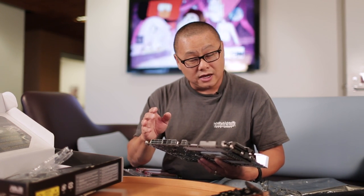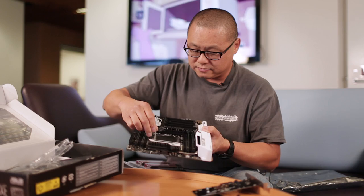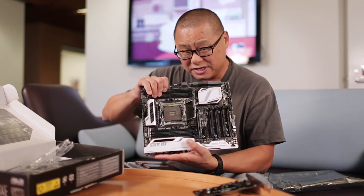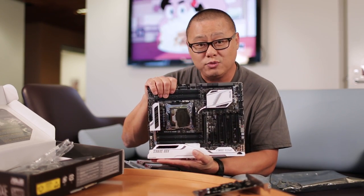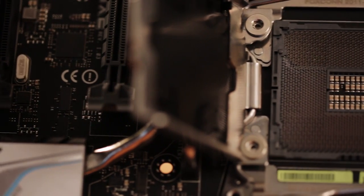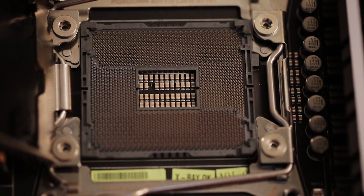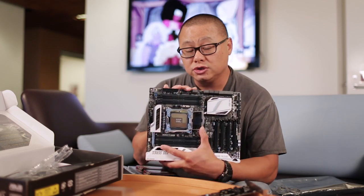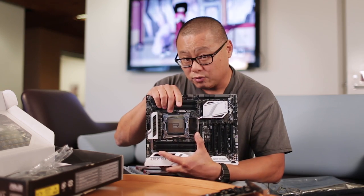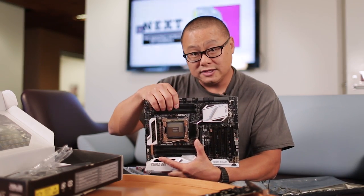There's also something Asus has done on this board that's a little different. I'm going to open up the socket and let you look inside. The company says they've actually found a secret way of adding pins to the normal LGA 2011 V3 socket to let you overclock the processor a little more. If you're expecting to get 4.8 GHz out of a Haswell E part, you're going to be disappointed — they say you should still expect to get 4.5 GHz with good cooling and a good power supply. What they've done is add additional pins so you can overclock the Uncore as well as the DDR4.